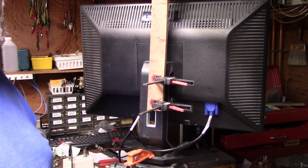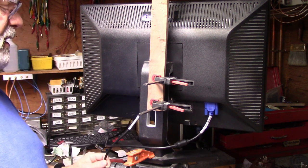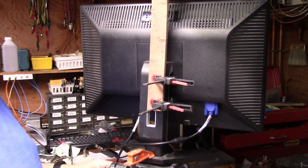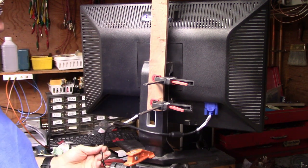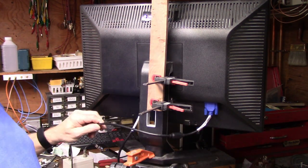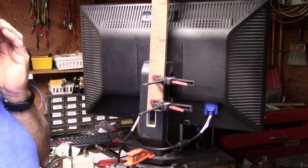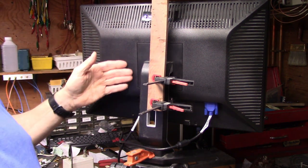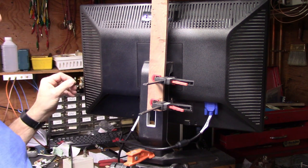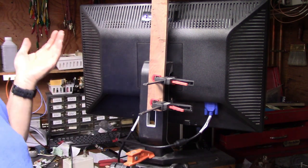We're running in really tight quarters tonight. Here's the video cable coming out, and here's the AC line cord going over to the wall plug. There's a possibility the noise is coming out of this AC line cord and getting into the house wiring, or the RF is coming back out through the ferrite here and the ferrite on the computer, or the noise is radiating right out of the front of the monitor.